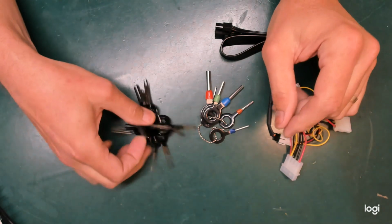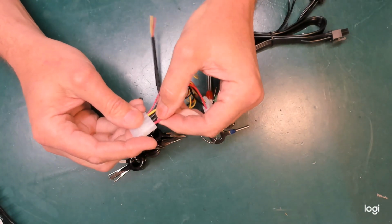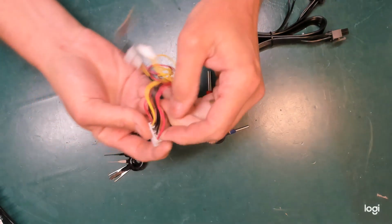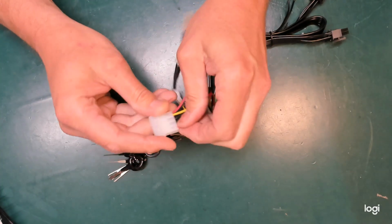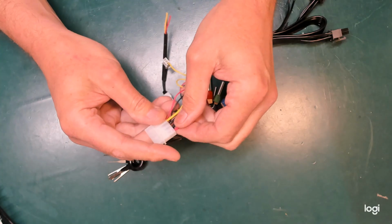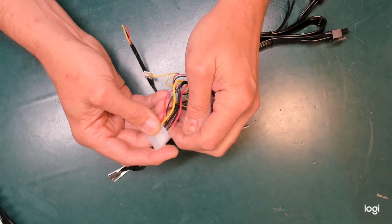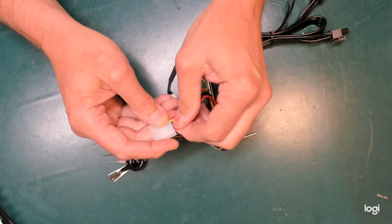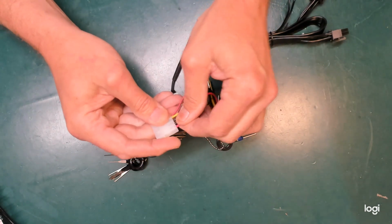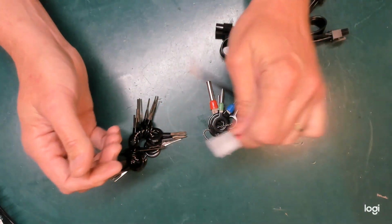For what it's worth, when I'm assembling these myself, I normally crimp them only ever so gently, just so that they fit into the connector properly, and then solder them in place with a bit of flux and clean them up nicely so that they're just right. And then I'll usually do the crimp around the insulation to act as a strain relief for the solder joint, and then won't try and squash the solder, it'll just damage it. And of course this is only for data and very low voltages.